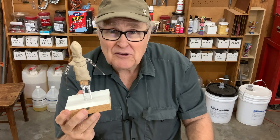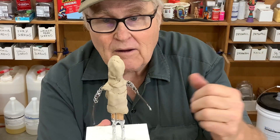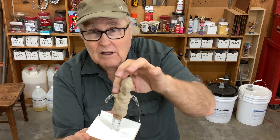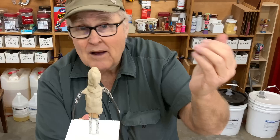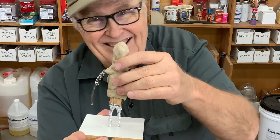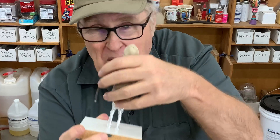What about vacuum? Same exact problem except in reverse. All of the air that's trapped inside is going to want to come out and expand. If you were lucky, it would come out of some little hole — the whole thing would suck out as one little hole. But you're not going to be lucky. It's going to have pockets of air trapped all around it, and each and every one of those pockets is going to expand. If it's clay, it could expand out until the clay breaks. Now you've got voids inside the model that are vacuums — and guess where all the rubber goes? Now you have a model that's completely infused with rubber, bonded, one with the rubber.